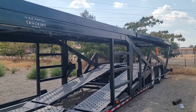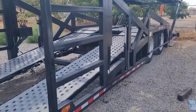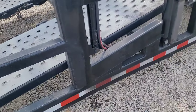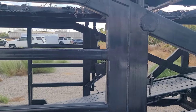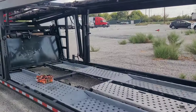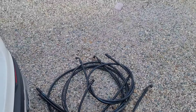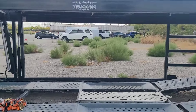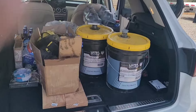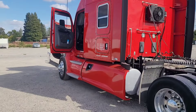Those are 53 inches so I can't use them in the front. My main concern was to replace those two because they raise the top deck — they raise car one and car two — and they leaked a lot. So I got new hoses. Old cylinders are still good, and that's it. I'm gonna do the oil change next. These are my old hoses — I'm gonna keep them, they're not bad, couple cracks, but I'll save them.